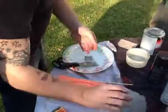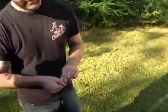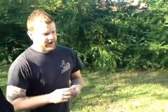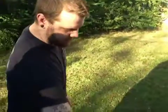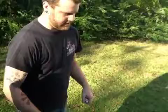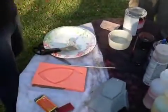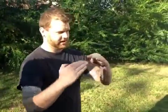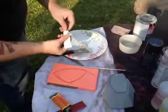I'm just going to Bondo the same piece. And Bondo is for when you have, like, you can use it to patch things, like patch cracks or patch holes in things. Spot putty's the same way, but spot putty is more for the minor stuff, and Bondo's going to be for bigger stuff. Especially on the pep stuff, if you've got a curve, like I was saying before, it's broken down into sections and it's not an actual curve. Bondo will put the actual curve in there, as long as you go back and sand it really well.